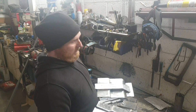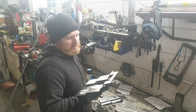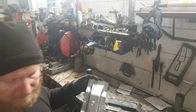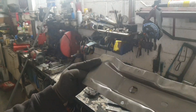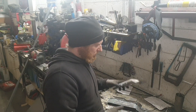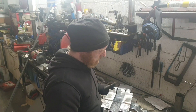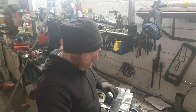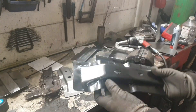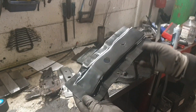I haven't used anything particularly special to make this. You could do it with a MIG welder and maybe an oxycetylene or oxypropane torch. Looks the part — almost like something you could buy. And it fits as well. A slight modification to the dies was needed; the first iteration wasn't deep enough. And after a quick squirt with some satin black, there's a proper part. It's brought out some of the hammer marks a little bit.